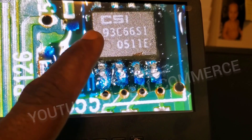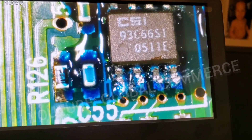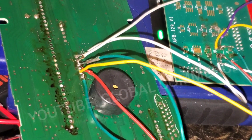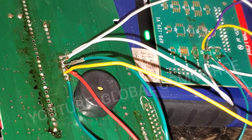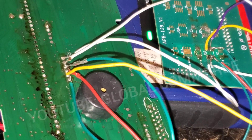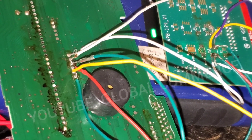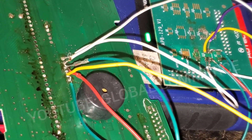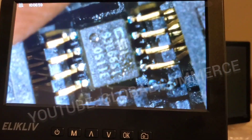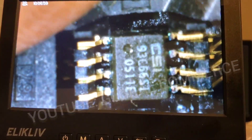We're going to put our clip with the red line onto that side for pin 1 and see if we can read it with the clip. The clip wasn't reading properly, and reading from my pin out trace is also not giving me a good connection, so I'm going to go ahead and just remove the chip and solder it onto the APB129. I went ahead and pulled the chip off with hot air.